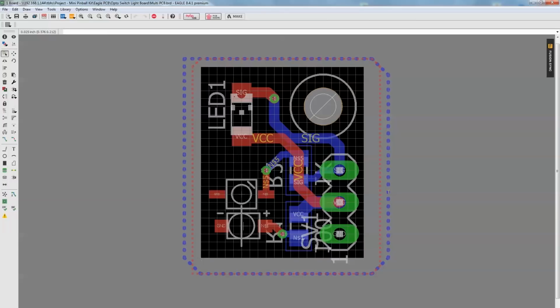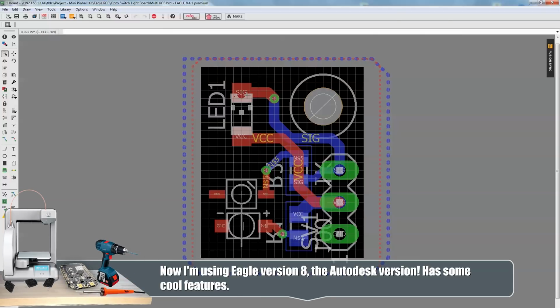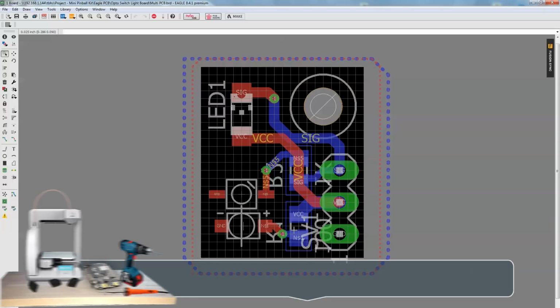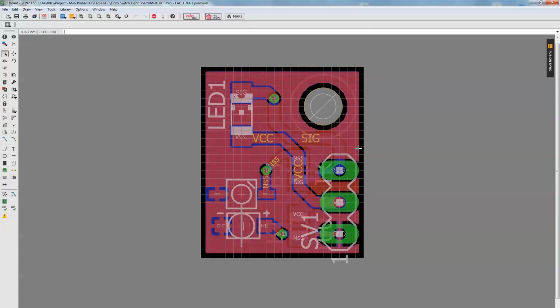I finished designing this really small 2-sided circuit board. On the top we have a 1206 surface mount LED. We also have the emitter detector pair right there. The appropriate resistors are on the bottom, and a place for a 3-pin header, kind of like a servo, and also a place to put a screw. So when we rat's nest, it looks like this. So it's got the flooded ground plane there.